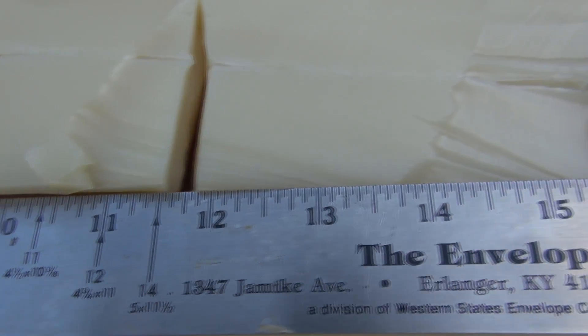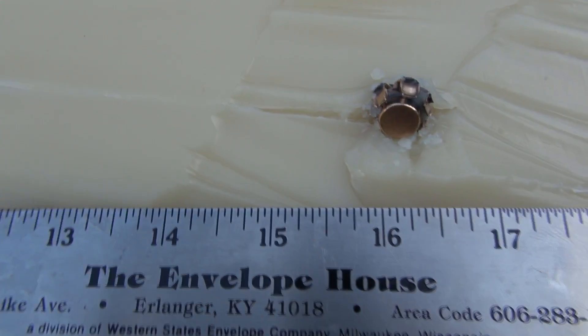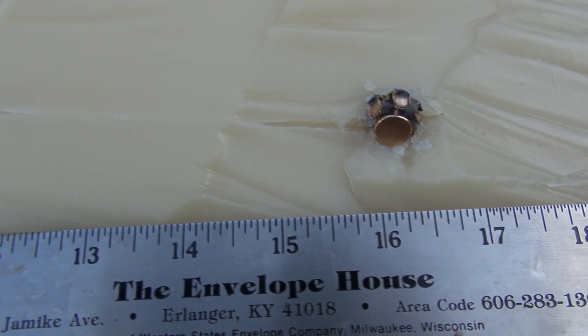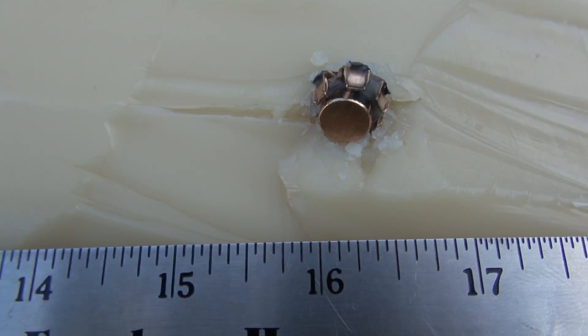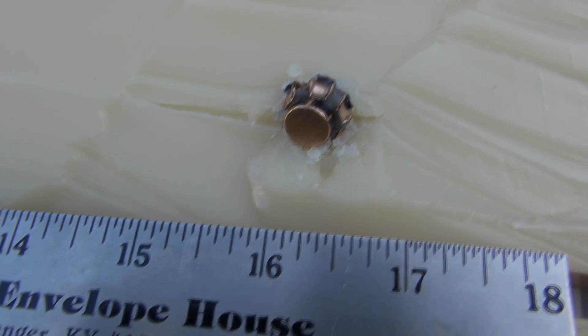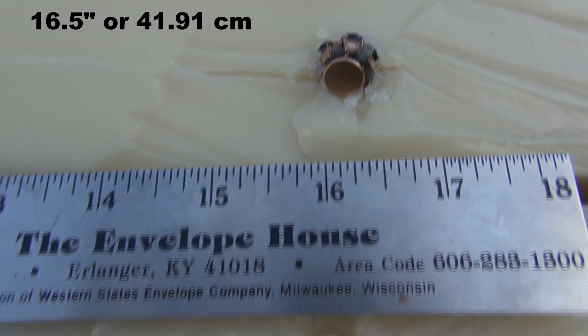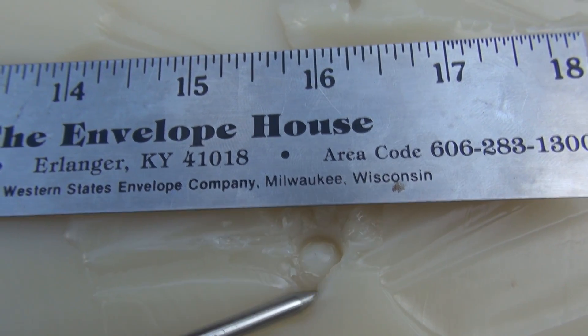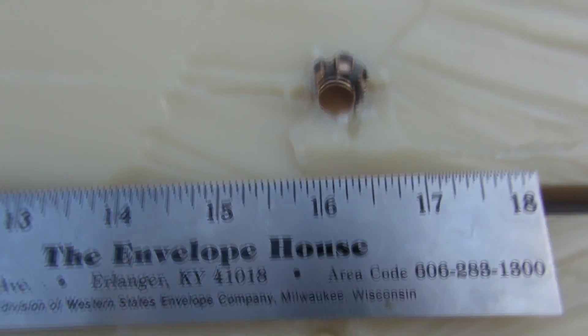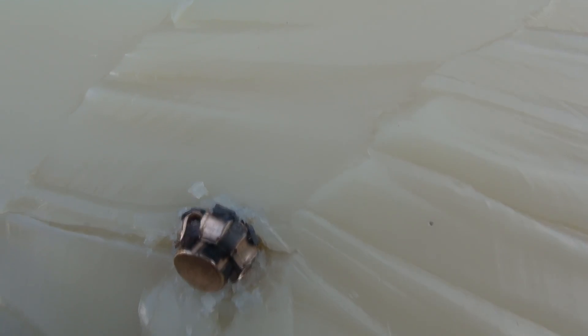Going back to our measurements, running 10, 11, 12, 14, up to 15 and 16 inches. A little bit deeper than what I expected, but the block is right at the high end of calibration at 3.72 inches. I'm getting 16½ inches. You can see where I split the block — the base was embedded right here. Looks pretty good on the expansion.